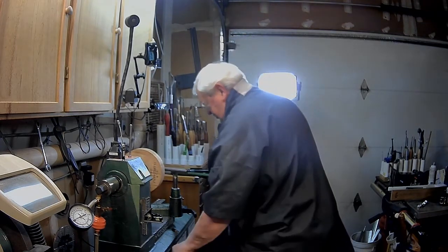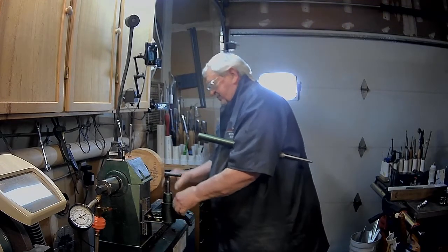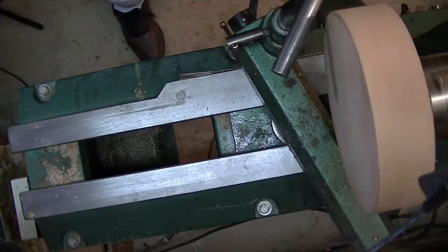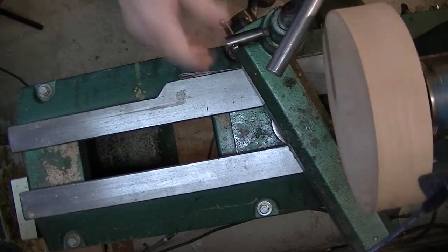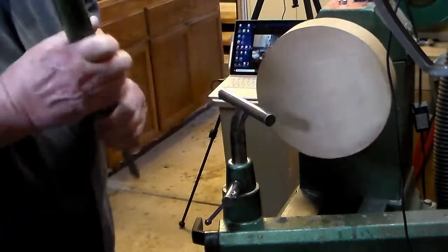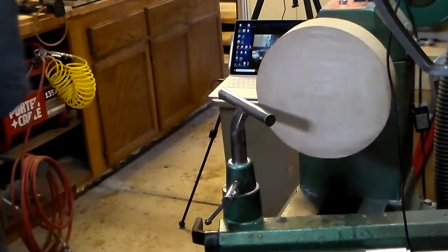So there we go. Lathe is on, speed is down at the lowest. And we're going to do pretty much some of the same steps we did before. I'm going to have to true up the outside of this. Let's see how true it is running. Yeah, it's off like I expected. And I want to be slightly above center line. And I'm going to come around this corner, square off this edge. After that, I will face this off. And then we'll be going on to doing something a little bit new, which will be creating the rebate in the bottom into which these jaws will set.